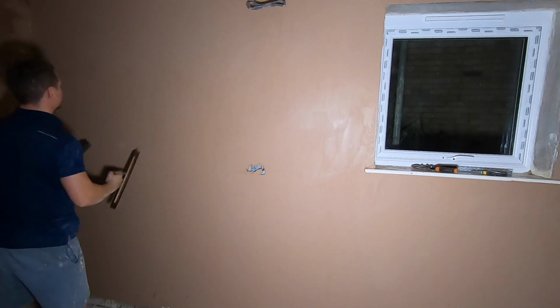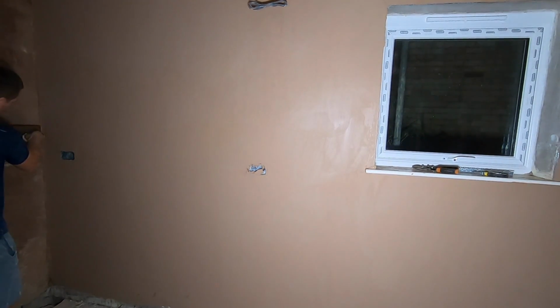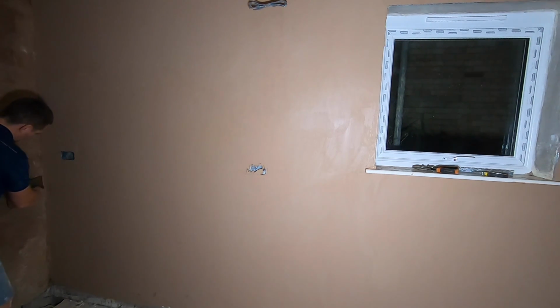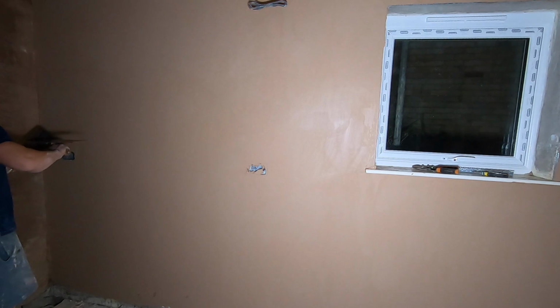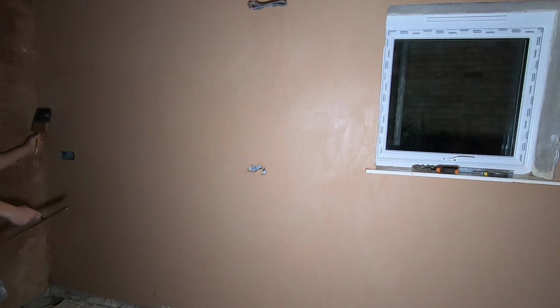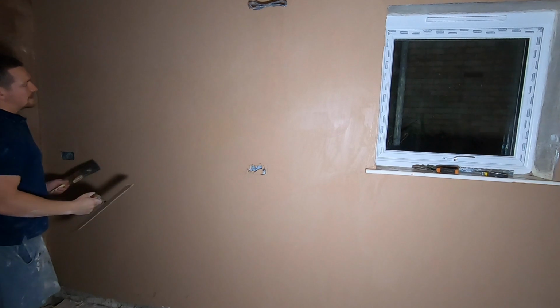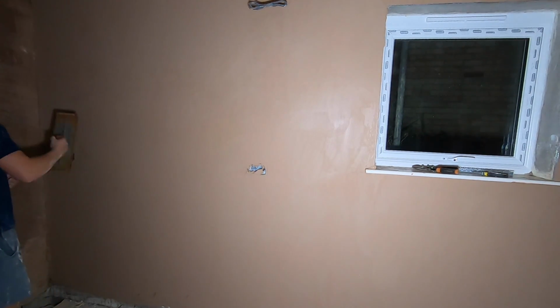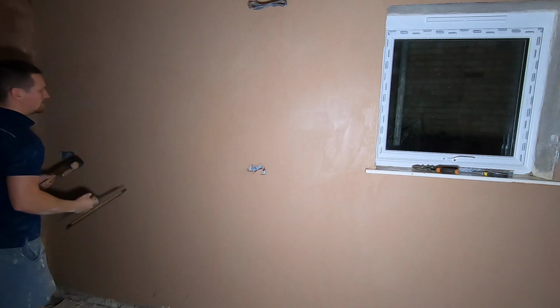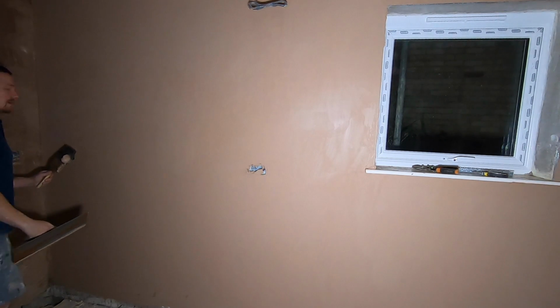You put the water brush to the wall, and you trowel across. What this will do is it lubricates the plaster. So you scrape the plaster on the sides away. Using the head of your trowel, scrape it away. Take the excess, and I'm going to pull them corners in. And then use your water brush, brush the edges, and trowel outwards. Again, the exact same motion that we used to apply the plaster with. Keeping your trowel flat to the wall. We're just troweling that plaster flat.